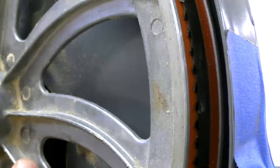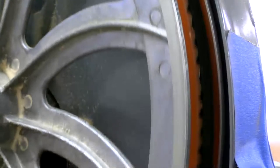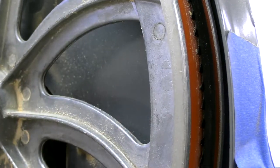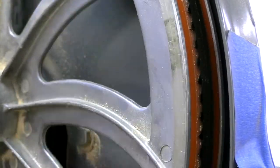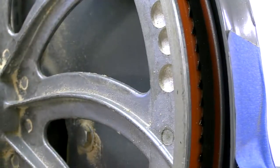So I'm gonna tighten that knob, and that blade moves back on the wheel. Let's see if I can go too far. This one's just a thumb knob, so it's kind of hard to get the tension. But that blade is now going a little too far in the other direction. So it just so happened to be in the right spot. It is centered on that wheel. I'm pretty happy there.